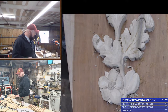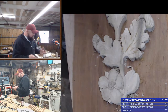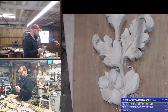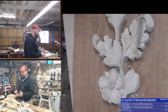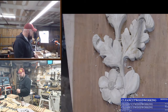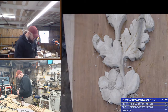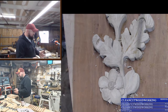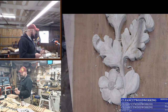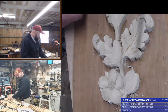With whatever you need, but you got to have them sharp. When I started doing it, I didn't realize the importance and the value of sharpness. There's a million different ways to sharpen the tools. I researched different ways, tried oil and different kinds of stones, and what I found is that I hollow grind all my blades except for carving chisels and these stubbies.